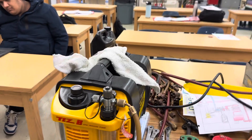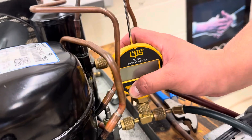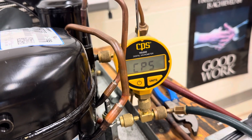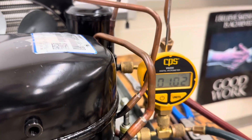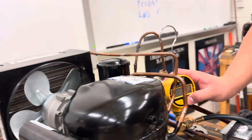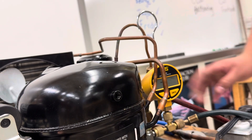You're going to need a plug — go ahead and pull that power cord down and get this thing plugged in because it is going to need some power. You can go ahead and turn the micron gauge on, which will start at atmosphere. Hold the button. It's got its little splash screen. Now, is that in microns? You want to check the units. You're plugging in the vacuum pump — make sure it says micron. Switch the unit button until it says MIC.